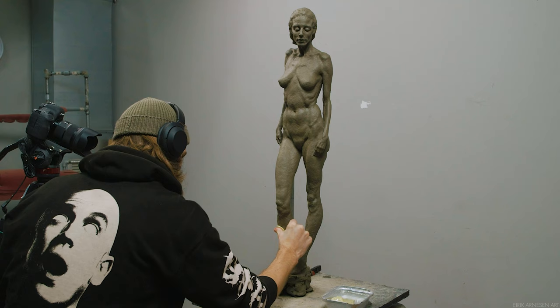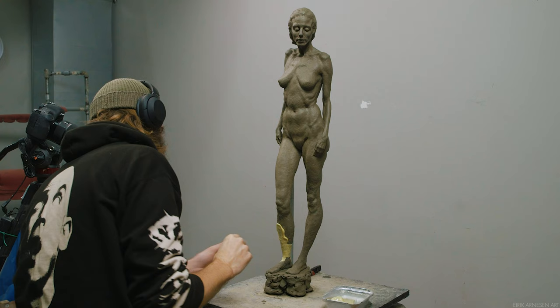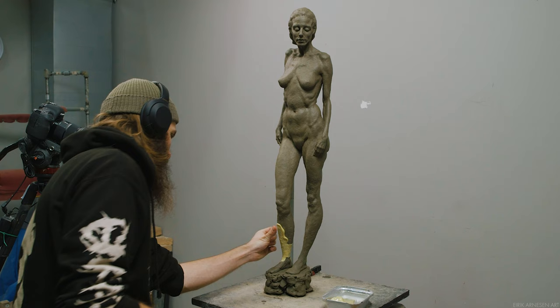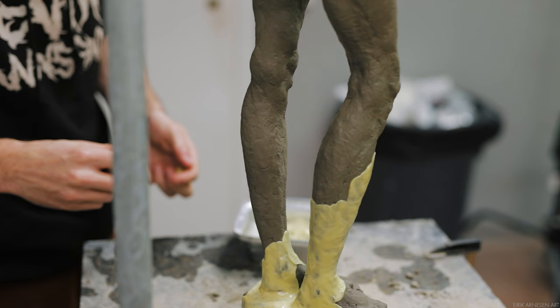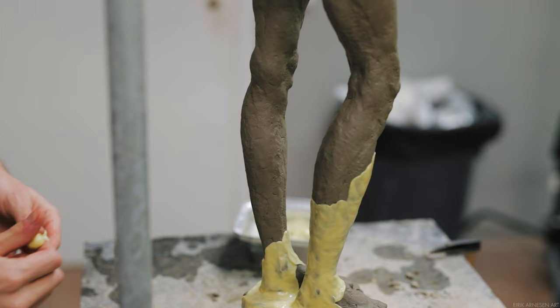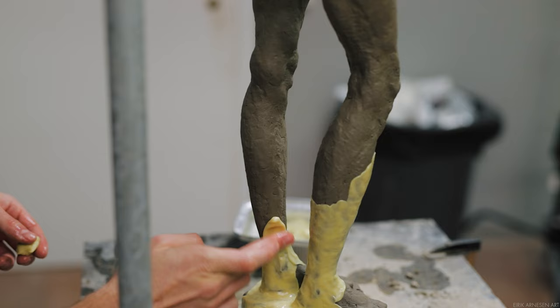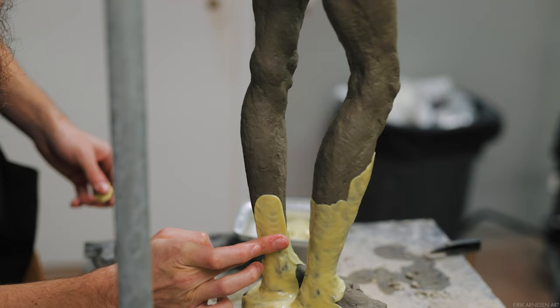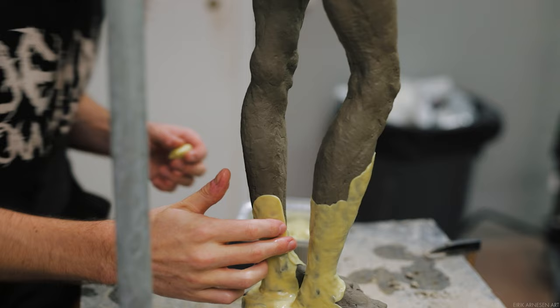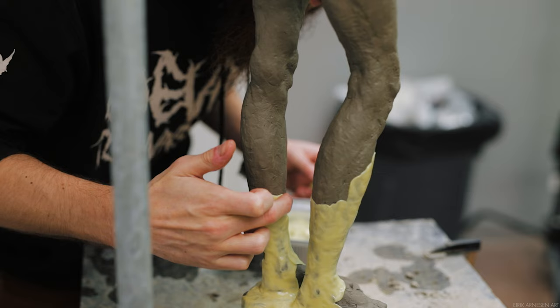The application is easy and straightforward. I put a small piece on and squeeze it outwards, working out air bubbles as I go. The thickness for this first layer should be very thin to avoid air bubbles, as any bubbles will show up on the surface of our casting. This first layer captures the surface of our clay sculpture. I like to have this layer so thin that I can almost see the color of the clay through the silicone. The thicker the layer, the softer it will seem under your fingers — you can judge thickness by touch.